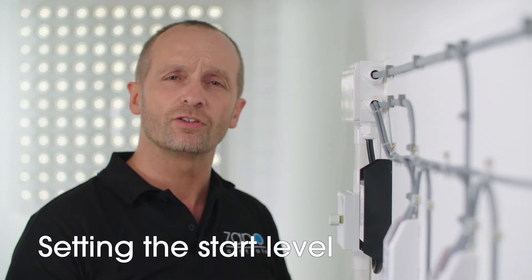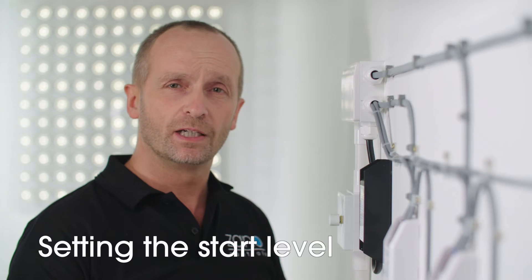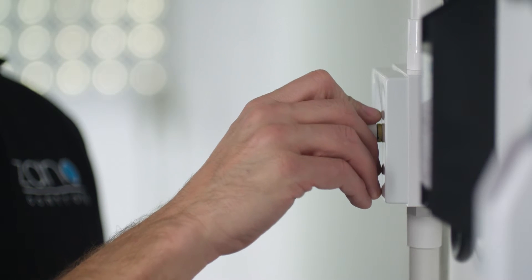Next, it's time to set the start level. You have five seconds from the last flash to begin. Just use the control to select the level for the lamps to turn on, then release and wait for five seconds for the lights to flash again, and the setting has been saved. We've introduced this feature because some LEDs simply won't switch on at a very low level. The Z-Bar LED enables you to set the lights at a slightly higher level for when you first start them, ensuring that all the LEDs get enough power to come on evenly, but then allows dimming down to the lower minimum level. This helps to achieve the very best dimming range for your install.